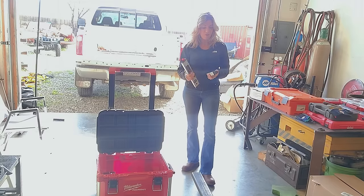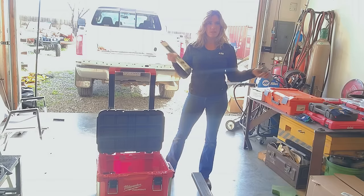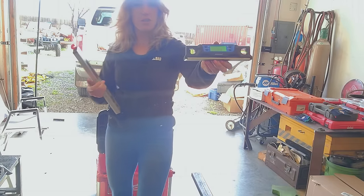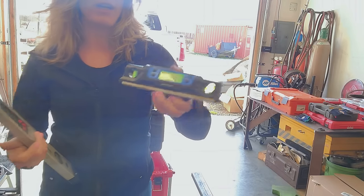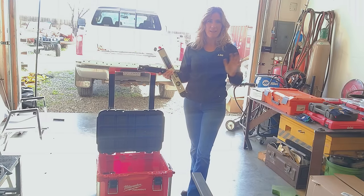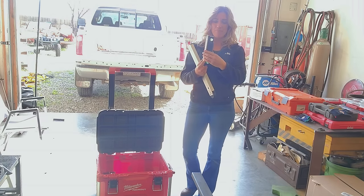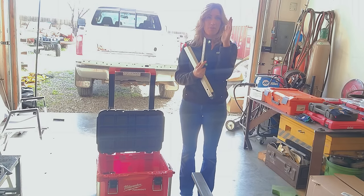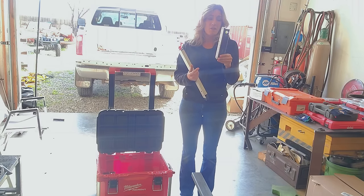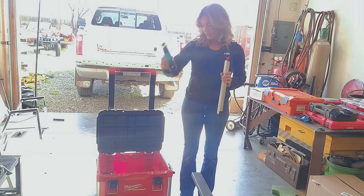So a couple of my extra favorite tools that I like to bring for when I'm doing any kind of hand railing. I always have levels, and those are fine, but to have these additional levels that I have, this one's a digital level, so when I'm doing anything that has slopes on it, I can make sure that I'm getting the proper slope. And even sometimes, working on any kind of house, any kind of anything that's been built, you do want to check and make sure that you're at a 90 degree, because sometimes you're off. And so when I build things, I want them to be perfectly matched to the house or to the side of the wall or whatever it is that you're matching things to. So, if something's going to be 86 degrees instead of 90 degrees, I want to make sure that I have that. So this digital level is really great.